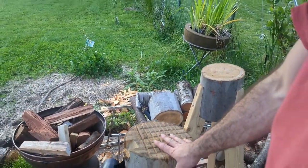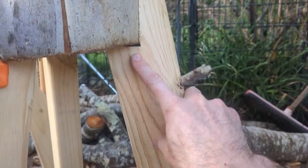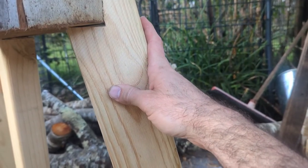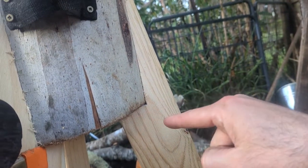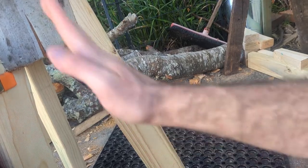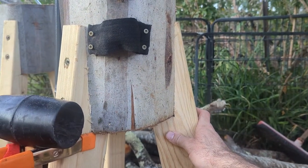Anyway I hope that helps you on your journey a little bit. The angles of the legs — I can't remember what that angle was, but if it helps, this was cut at a 15 degree angle back. So if you want to set that angle, it would be easy enough to set your saw — if that's square, obviously 90 degrees — 15 degree angle back, and then if you make that into a 90 degree angle then that will be your full run. I don't have a protractor or a square on me right now to check that, but I thought if somebody wanted to replicate exactly what I've done, that's a really good way to start.